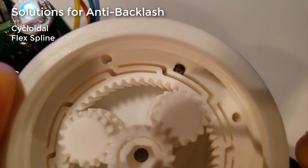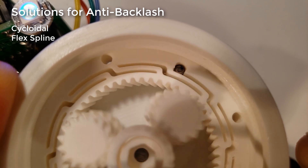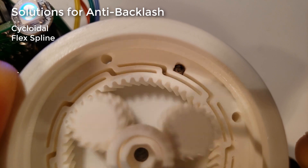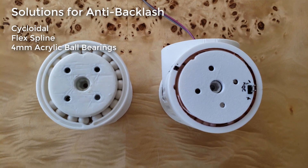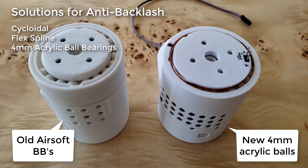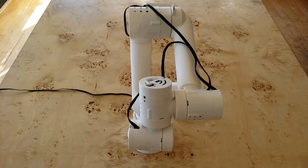This is now the new design I'm going with. It did end up being a wider actuator than the original, so I had to redesign the shell — which was actually good because I needed more room for the ESP32 and the custom circuit board. The new design also uses 4mm acrylic balls instead of the prior Airsoft BBs, creating a much nicer slew bearing for a better all-around solution.